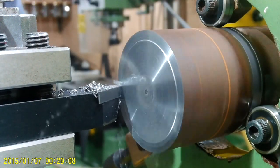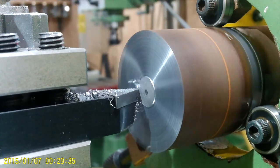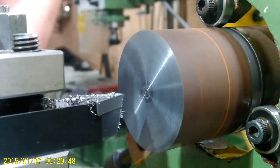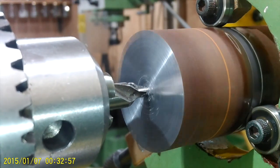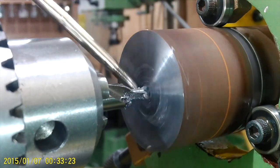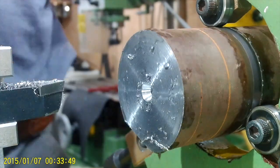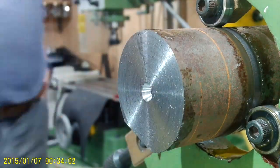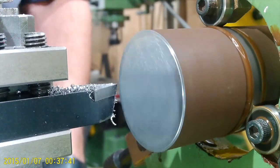Because I'm going to machine the material between centres, that means after facing off, putting two centre holes in each end. One pair in the centre and one pair offset by 7.34mm. The pair of centre holes are just straightforward plunge cuts using the tailstock. But to set and make the two offset holes, a little bit of work is needed first.